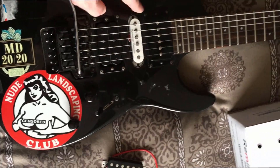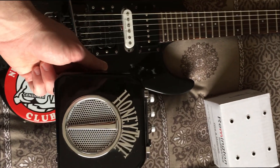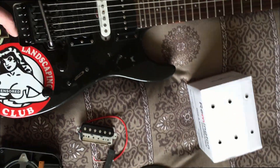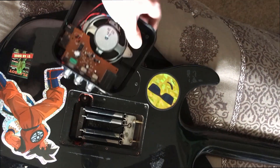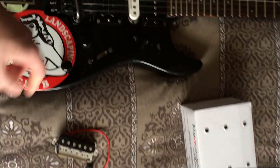What I'm going to do is take this pickup and wire it to the input on this Honey Tone amp. Then I'll take the output of the Honey Tone amp and use it to drive the windings I'm going to add to this pickup — where I'll be putting the copper windings. I'll remove the tone control and selector switch, have the bridge pickup go straight to a volume pot and straight to the output jack, then drop this board inside the control cavity.